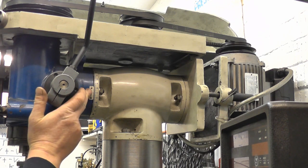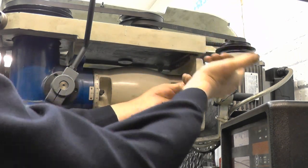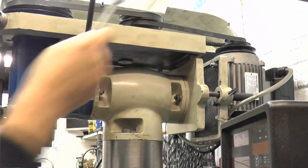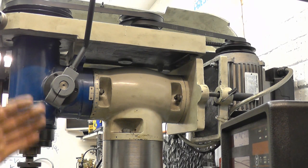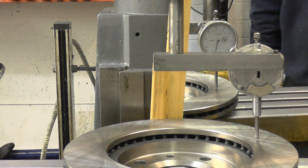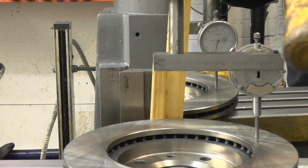There's actually a graduation on here in degrees. There are also four nuts that clamp the head because the head can tilt. All you do is loosen them off — not fully loose, just leave a nip on them. That'll allow the head to tilt that way and that way so we can get the tramming done. I've got the bolts that clamp the head loosened off but still nipped, so all I do is gently tap it.